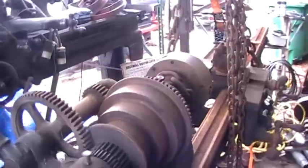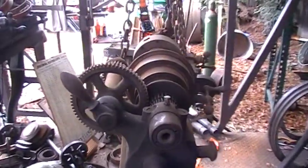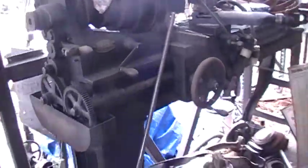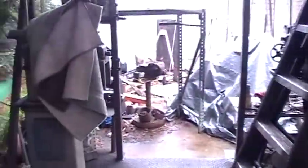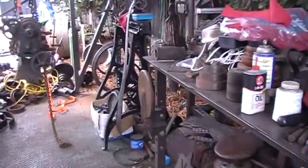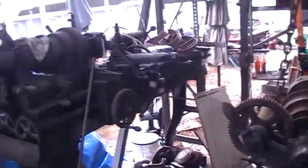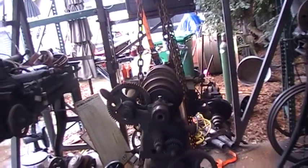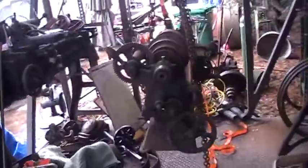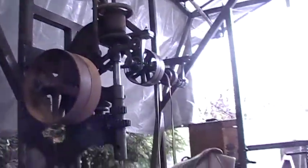On the trailer I have size constraints and don't have a lot of real estate. This little lathe here won't fit back there — only a four-foot bed fits back there. The WP Davis is a five-foot bed, that's kind of why they're up in the front. I've been building more stuff in the back because this is a tandem axle and you've got tongue weight. This lathe is probably about 800 pounds, so I have to put some weight on the other side of the axles to balance it out. At a 5,000-pound trailer I should have around 500 pounds on the hitch, since this is just a bumper puller.